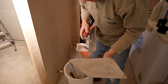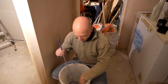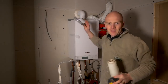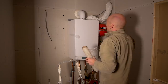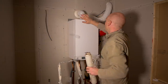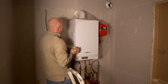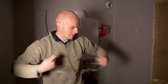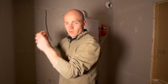It's going to be a little bit of a clean-up from the last plastering I did, which was a good while ago, but usually I get away using the SDS drill with a mixer and just an SDS chuck on there. First things first, I need to look at wrapping up this boiler a bit. All of this area is going to be completely concealed within a cupboard, so I'll skim the exposed area and feather it into the bit that's going to be completely hidden. Put a little bit over our valve, because the last thing I want is plaster on our isolating valve. You can just use disposable gloves or something over there — it's quite handy.